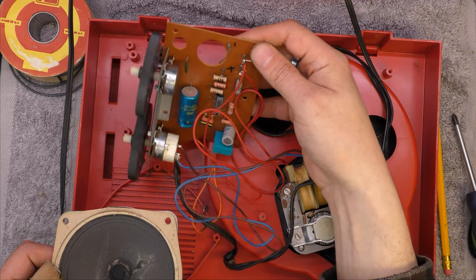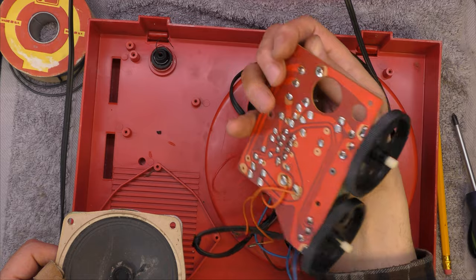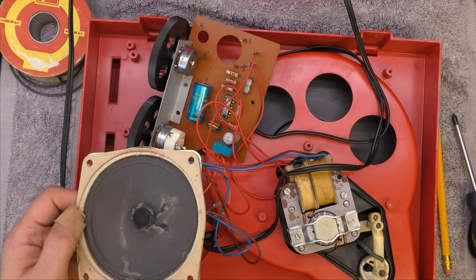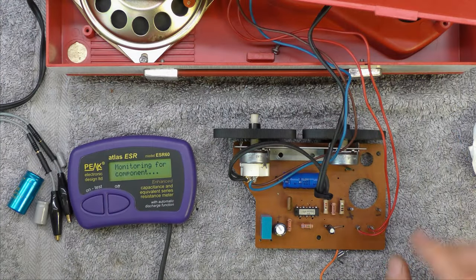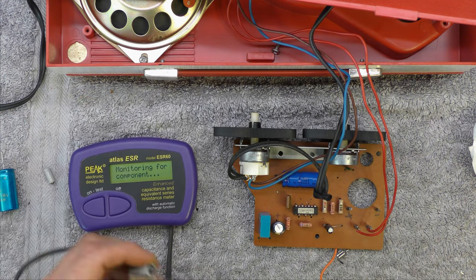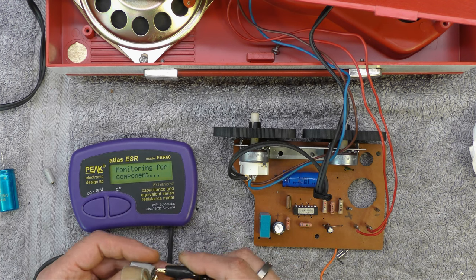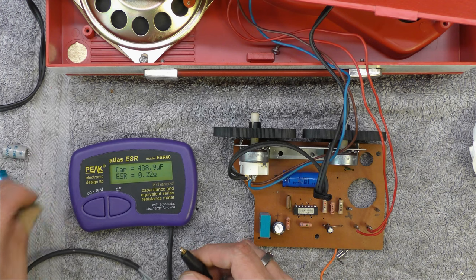Well, after unsoldering the cartridge wires, the circuit board just comes off. The speaker needs a dust - I thought I might take that out just because sometimes these things get dust in and it causes a rattle. Okay, so I've recapped it - only three electrolytics to change, nice and simple. These have all altered value. This is supposed to be a 300 microfarad but it's risen to 500, so it's either leaky or just shifted. The ESR is not bad but the capacitance is way up.